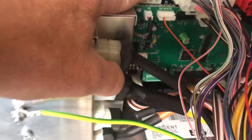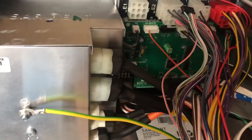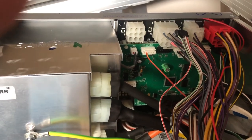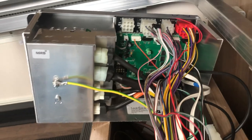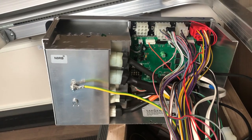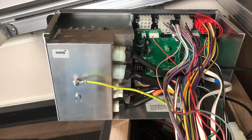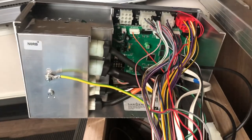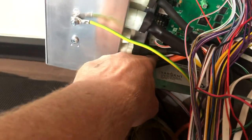So E1 isn't giving us 12 volts, which means the only solution is to send this board off to Sargent. This one unfortunately isn't under warranty, but they do a repair service that dealers and the public can use — you send it off, it gets repaired for a fee, and sent back. To summarise: it could be the wiring, the alarm, the light itself, or the switch, but in this case if you're not getting a positive 12 volts out of that wire using an earth down there, that's the problem. Thank you very much.